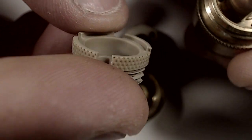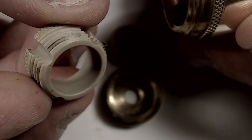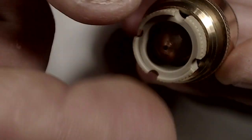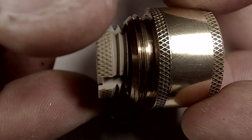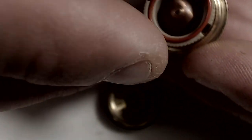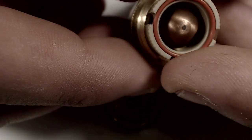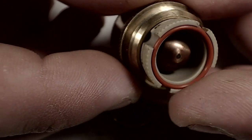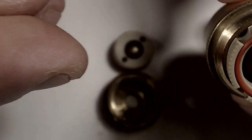These are the plastic battery height adjustment pieces — you can see four holes or channels for venting. The threading on this plastic spacer is reverse-threaded, so you turn it counterclockwise to thread it on and clockwise to expand it — clockwise extends it, counterclockwise makes it retract. They also give you an o-ring that sits right here for battery cushioning. I don't think it's strictly necessary, but since I have another o-ring that fits in there perfectly and it protrudes just a hair, I'm fine with it.